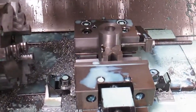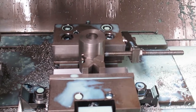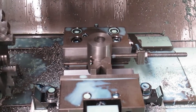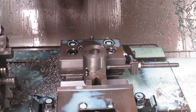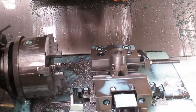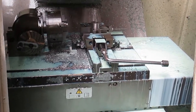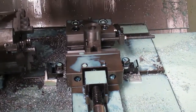We're down at the local machine shop. We've got the main part in the CNC machine - they're going to dust the top off, face it, and then bore the one degree hole, 35mm diameter and 5mm deep. We're just going to get set up and I'll bring you back when we're cutting. I'm not sure how much we're going to see when we've got the coolant running, but we'll try our best.